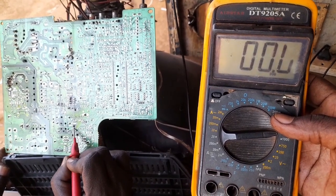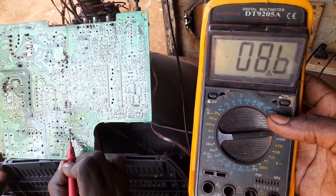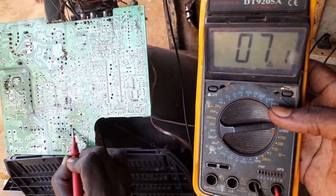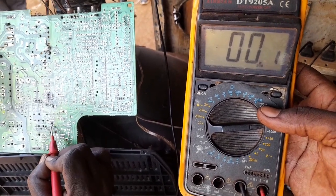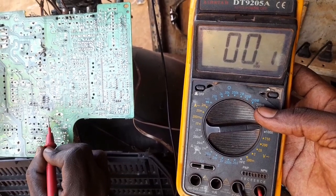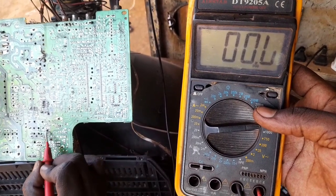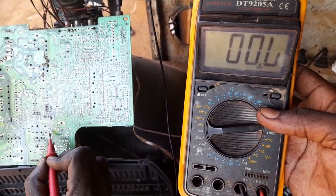Now, after that, in the middle, this is the base. So within here, in this case, they have used the regulator 8. Because collector voltage is 10, base voltage is 8, and then of course that means you put a Zener diode somewhere here. A Zener diode will also need an explanation, but when you put a Zener diode around somewhere here, on the base of that transistor, the emitter voltage output will be 8 volts. It is the same to be done on 5 volts.